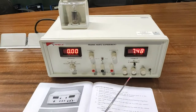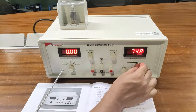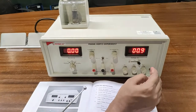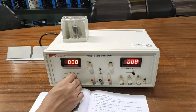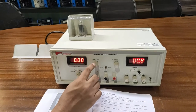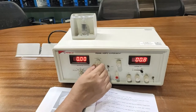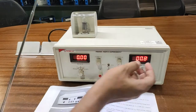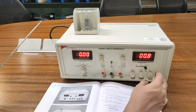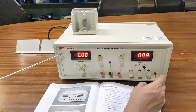As mentioned, VG1K and VG2A are constant voltages. Now turn the voltage adjuster to VG2K and accelerate the voltage using the VG2K knob so that electrons can pass between anode and cathode. Set the current multiplier knob to 10 to the power minus 8 position. Take the filament voltage to the medium position. Then begin increasing the VG2K voltage so that current starts increasing — note the current reading after every one volt increase.